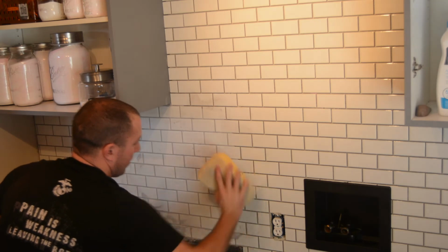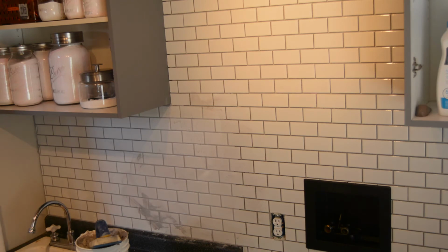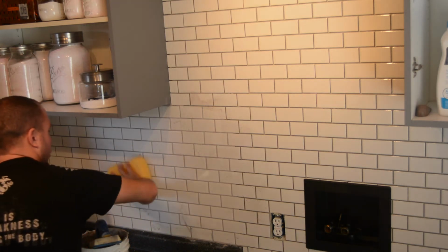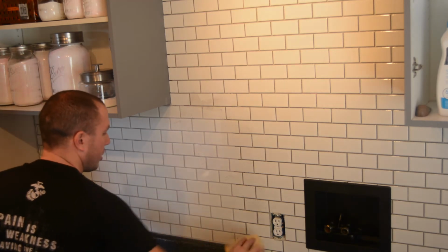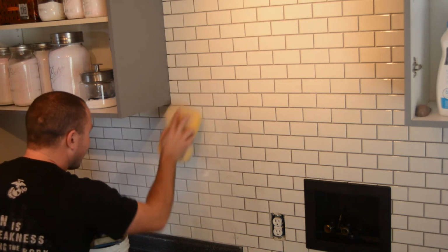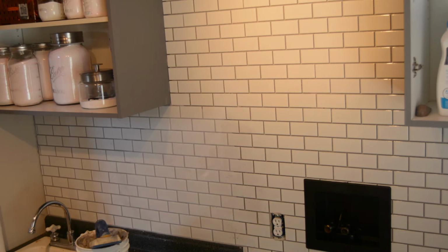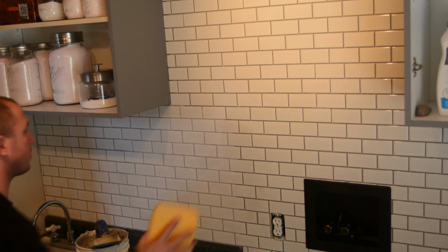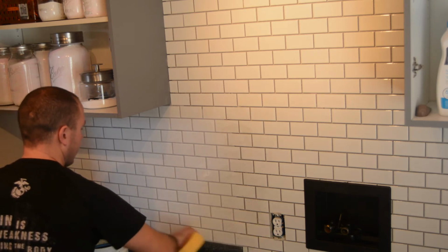So sometimes you'll forget about wiping at a 45-degree angle. You'll go in there at a straight angle and wipe your grout, and then you'll be like, I forgot. Everybody's human, so even while I'm doing this, you remember, oh crap, I shouldn't do it like that. Well, you get excited, you're worried about it drying, you're trying to get it off as fast as possible, so yeah, you make mistakes. Who cares? As long as you don't totally hack the project, at the end of the day, you're only into it your time and the supplies to get the project done. So it's not the end of the world if you mess something up. You can always go back and redo it.